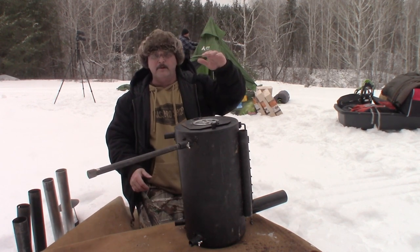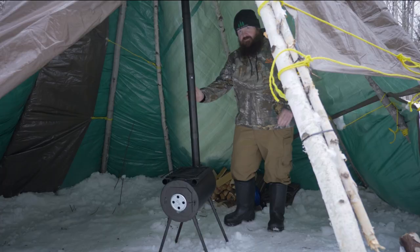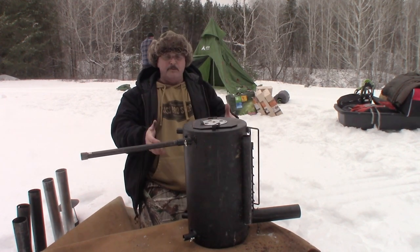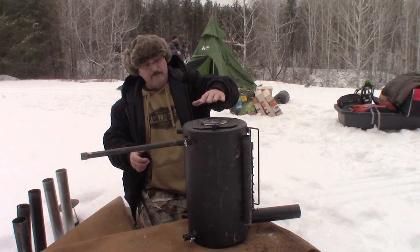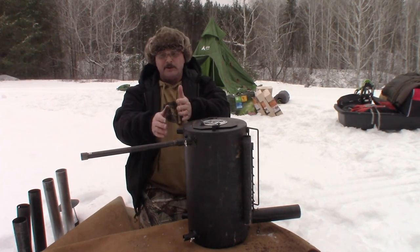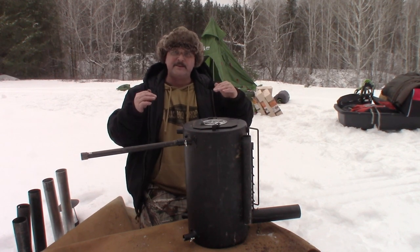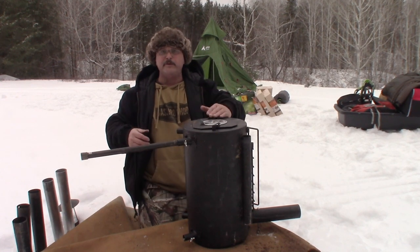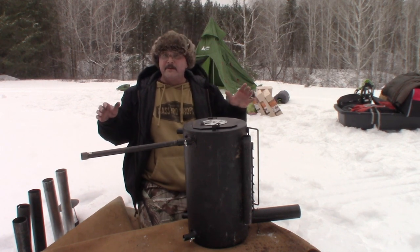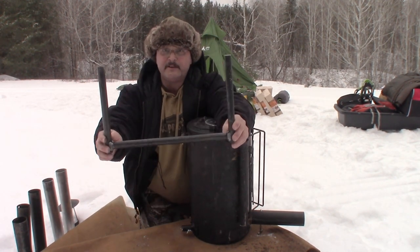The issue was the stove was, in our opinion, too high. If you flip the stove up and balance it on one leg, it's quite high. For those new to wood stoves: generally the distance between the bottom of the stove and the ground is very difficult to heat. The longer the legs, the higher up your stove is — you'll have high heat above but dramatically colder below.